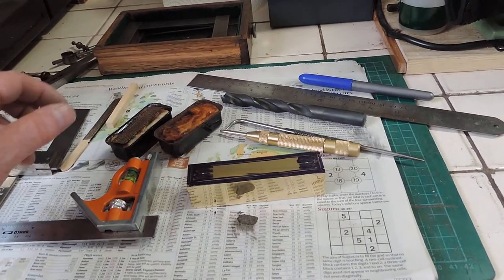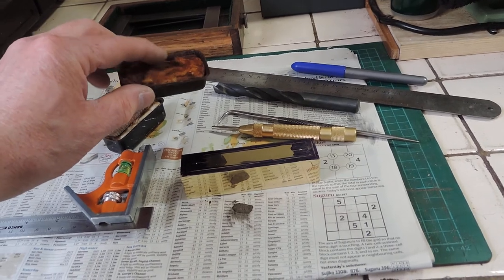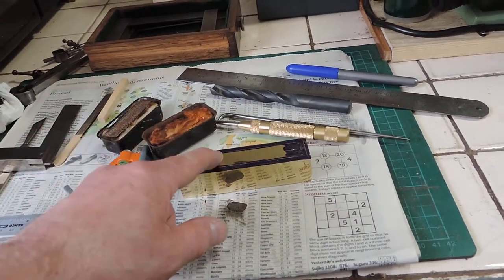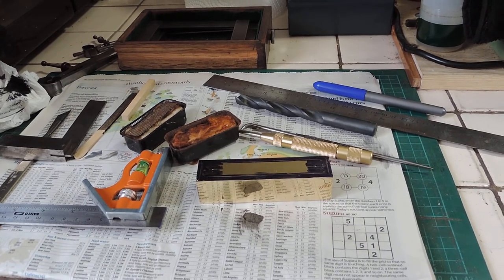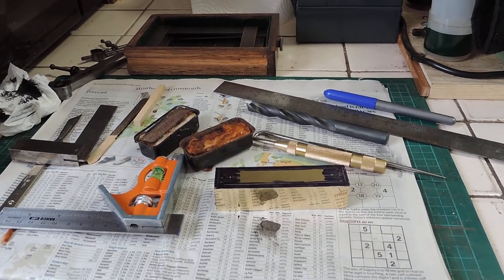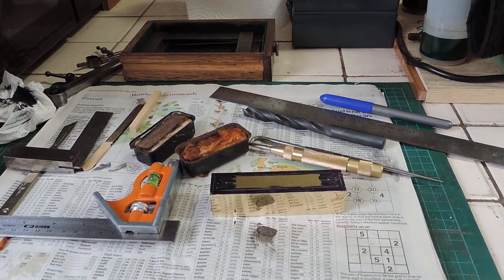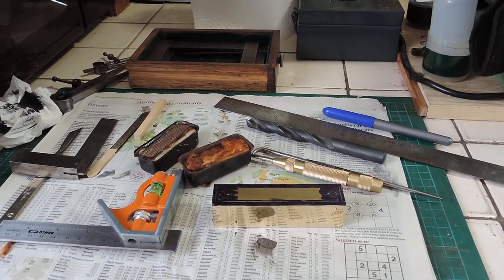The tops were completely rusted. I'm going to salvage the fiberglass matting inside, which will go inside here. Then we'll create a new gauze to go on the top and solder on a couple of small plates, one either end, then make the handle to go in one end. And we should have a perfectly serviceable burner. So I'm going to get on and do that now.